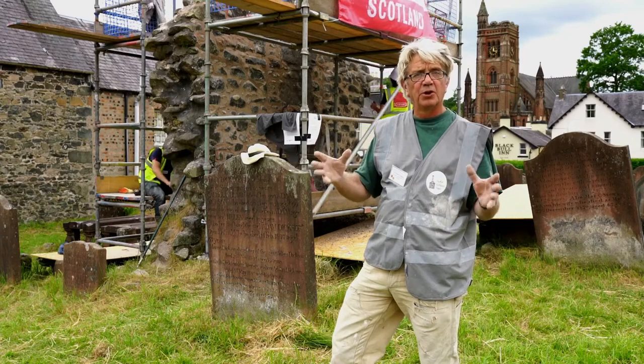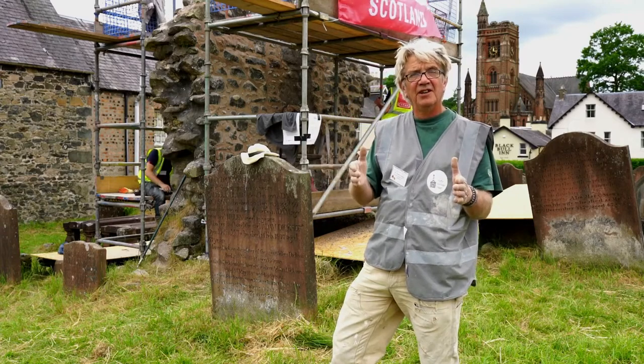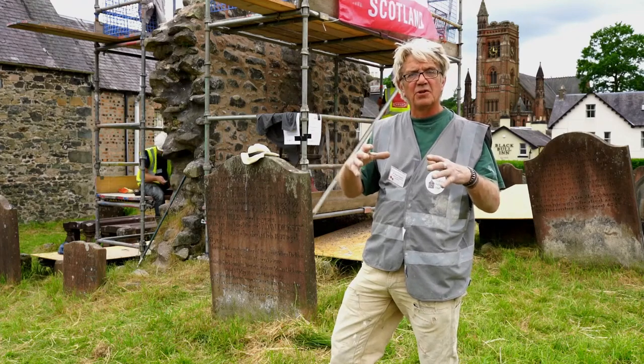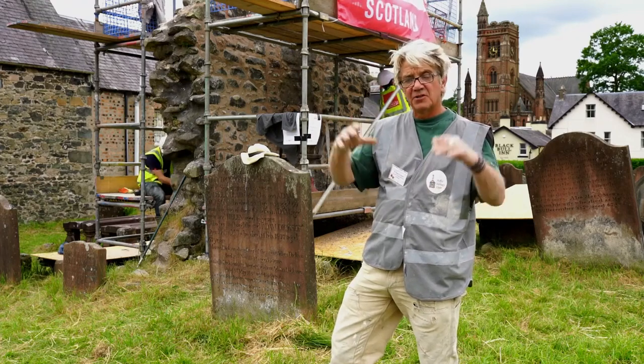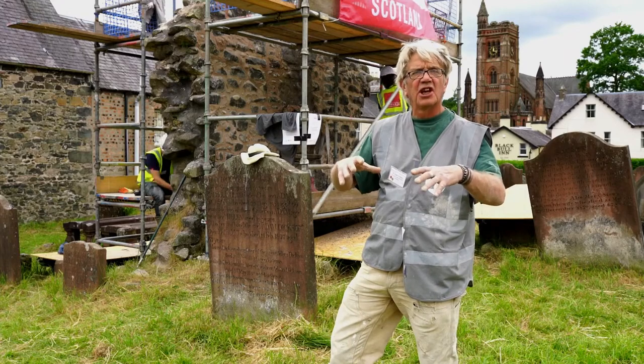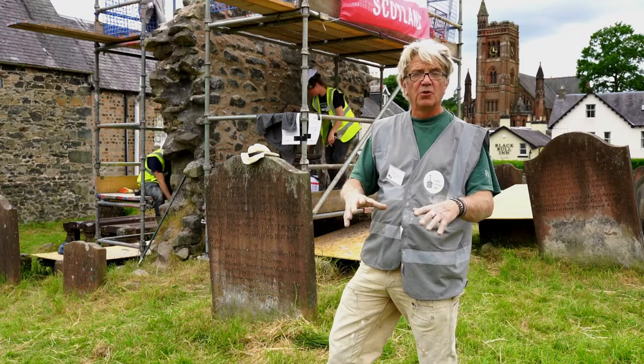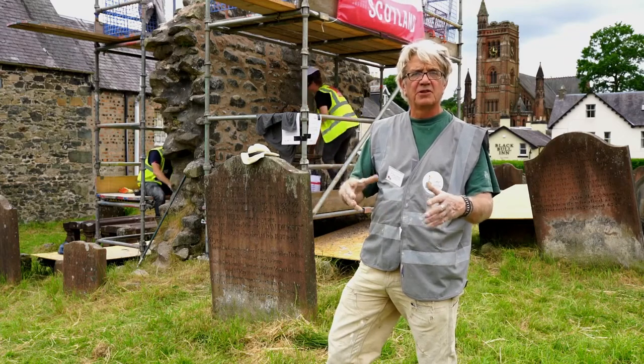On the tops, where it does get very wet, we're displacing some, at least, of the concrete cement that they put on there, but actually that's a place where concrete might be your go-to, because you don't want it to be porous in the same way, because it's receiving a lot of water and it just needs to shed that water. If it's soaked in too much water, being too porous, obviously it would be vulnerable to frost damage. So you change the mix.